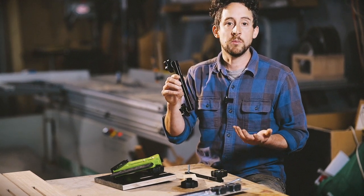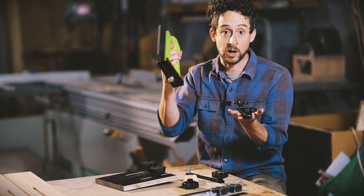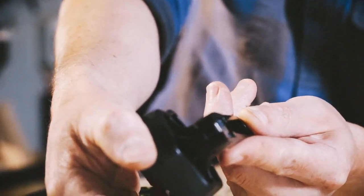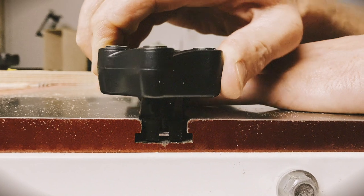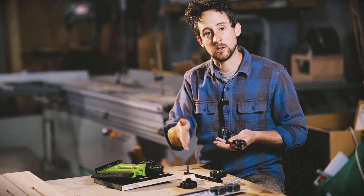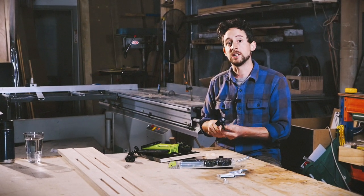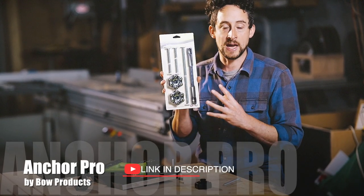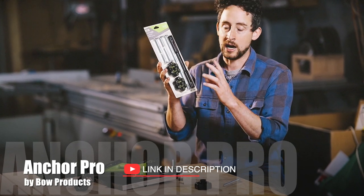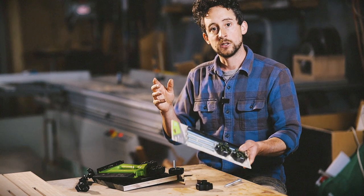This bar they've developed — and it may have existed in some form before, but I became familiar with it through their products — you drop it into the miter slot. It's connected to one of their work-holding devices or featherboards, and as you turn these knobs it expands and locks really firmly into the miter slot. That allows you to put featherboards onto the table saw or bandsaw and have them locked in place, not sliding. They then wanted to use this expanding locking miter bar for other jigs, so they developed the Anchor Pro — a collection of t-bar bolts, knobs, and locking bars in larger and smaller sizes.